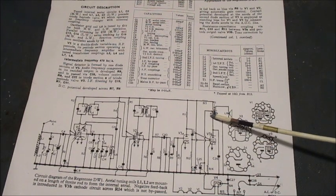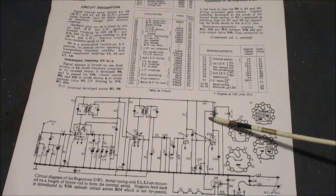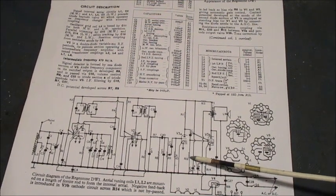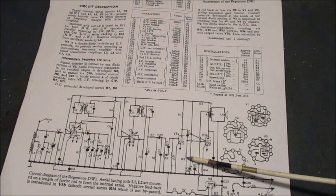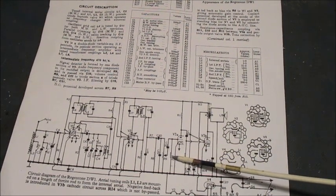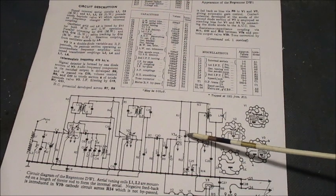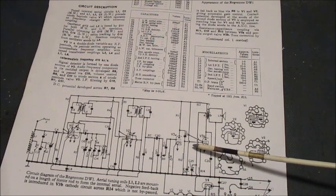Audio output transformer T1 with open circuit winding has been replaced. Carbon composite resistors R14 270 ohms at 1 watt, cathode bias resistor R12 470k grid 1 bias resistor for audio output section of the UCL83, and R10 control grid bias for triode section of UCL83, and coupling capacitors C23 and C22, both being 10 nanofarad, have been replaced.